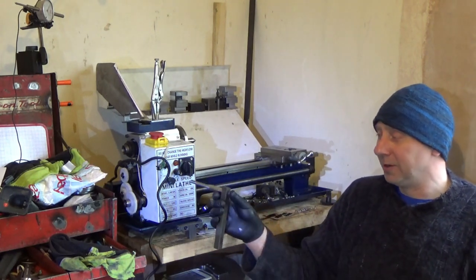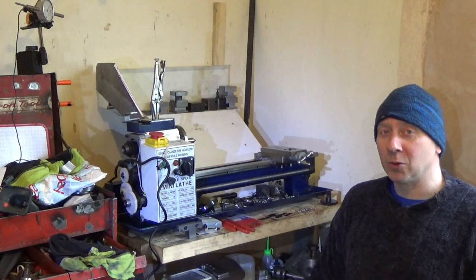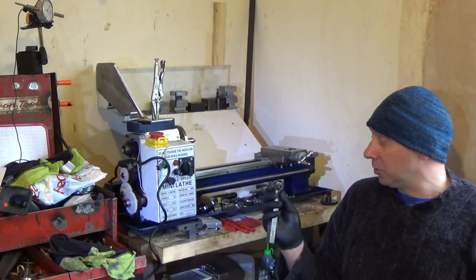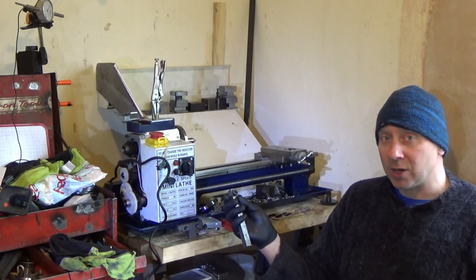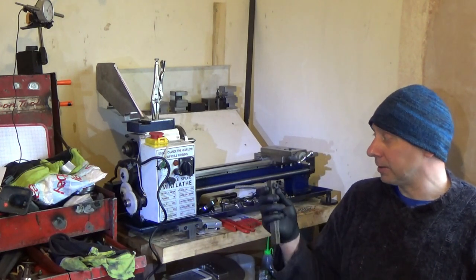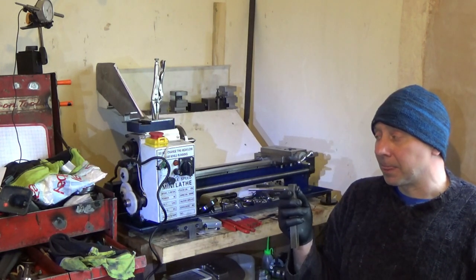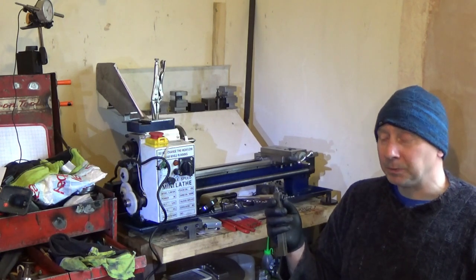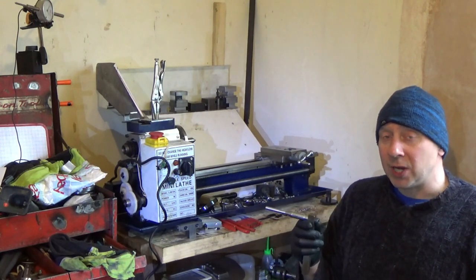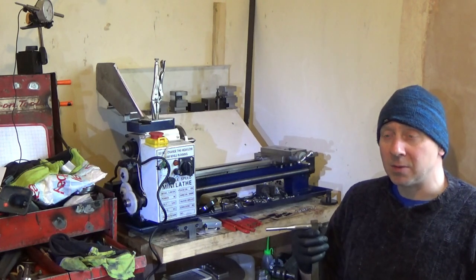I'm not sure how well this little DC controller in here that I've put in here is going to work and how long it's going to work for. I've got a lathe plate which fits inside the splash tray at the bottom here. It's 10mm steel and I'm using that to stiffen the lathe up slightly, and as the three phase motor mount as well. And that's cut to length, but it's not cut to shape, size or face or anything. It's just hot rolled plate, 10mm plate.